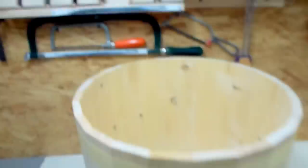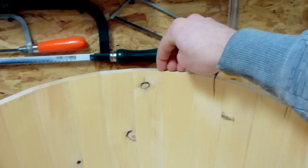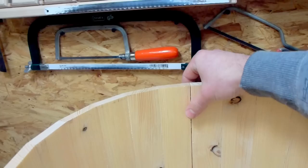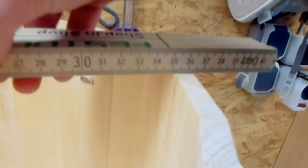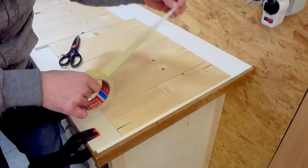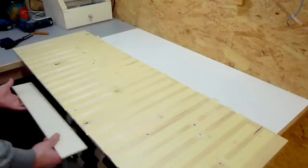But as you can see, not everything works perfectly on the first try — it didn't come out perfect, with a lot of wiggle and gaps inside. Screwing up on a 24-segment circle is not too hard: if I'm just off by a tenth of a degree, that adds up 48 times because I cut 48 times, so a tenth of a degree off means I'm totally about 4.8 degrees off. But I was shooting for a diameter of 35 centimeters — and it measured 35. I then noticed that the tape stretches quite a bit and only 3 strips weren't enough to hold it together sufficiently.